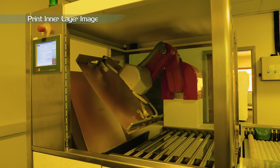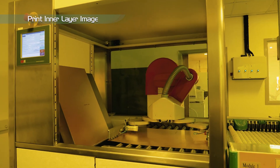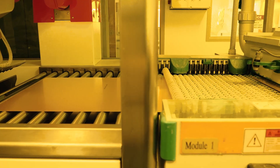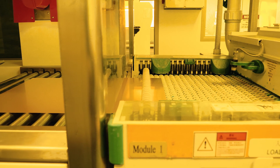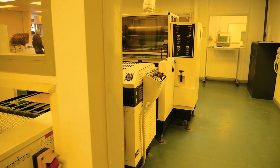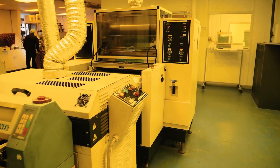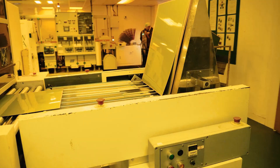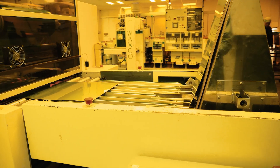The CAM image is transferred onto the circuit by laminating the inner layer material with UV sensitive, photosensitive resist. The inner layers are auto-loaded onto the cleaning line, passing through a chemical etch, dryer, FOD removal and preheat, before having the dry film resist applied to the laminate using heat and pressure.